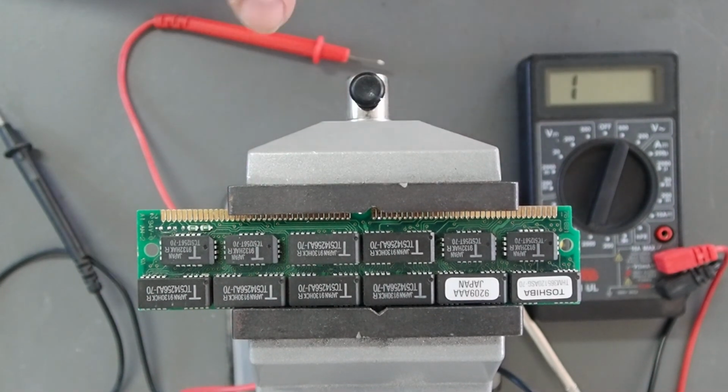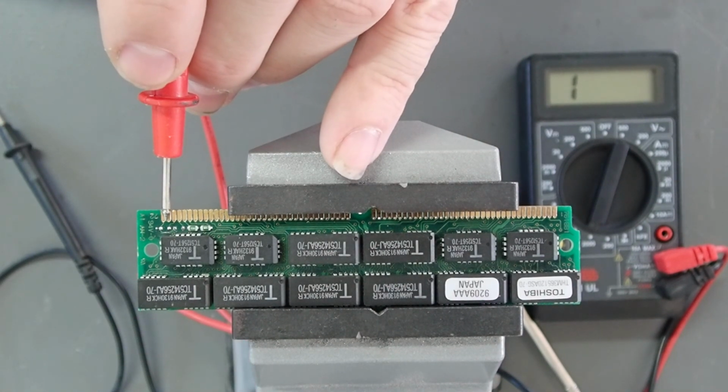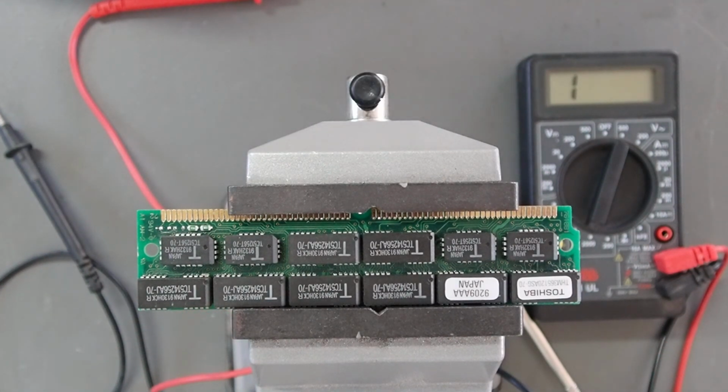With the bridge moved over, R3 would be closed, and R4 is open. That would be the correct setting, just moving one of the bridges. That's delicate solder work, a little bit of tweezers and everything else. I've normally used just wire wrap wire, where I have a handle on it to move it in with tweezers, and I solder across that area. As long as you're putting a wire bridge across that particular PD bit, you're closing those sense pins in this case.